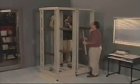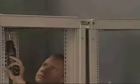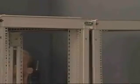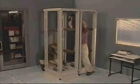Insert the four Phillips screws into the angle brackets to fasten the rack into place. Slide the top dust strip between the racks to rest on the top angle brackets. Once the two racks are aligned, tighten all screws on both racks.